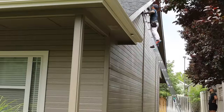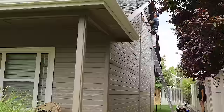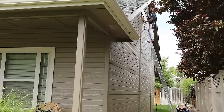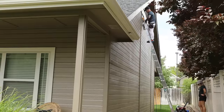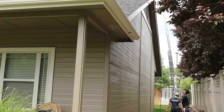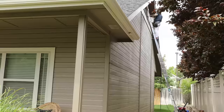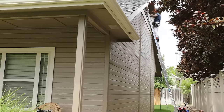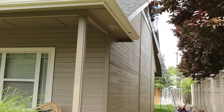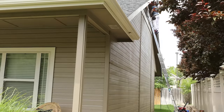You might notice on our extension ladders — I made a video on wrapping our ladder boots in plastic, and plastic has always worked really well. After the paint is dried, your ladder boots won't stick to the paint. This side of the house was really weather-beaten and sun-beaten — it looks extremely dry. I went back and sprayed this side two more times, masking it off to get a more even finish. That's not lighting causing it to look like that — it's the siding itself. We reshot it twice to get an even sheen across that whole side.